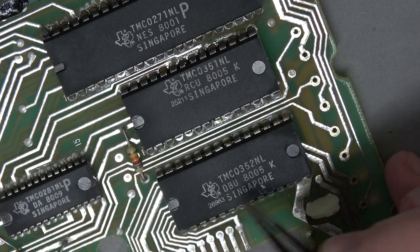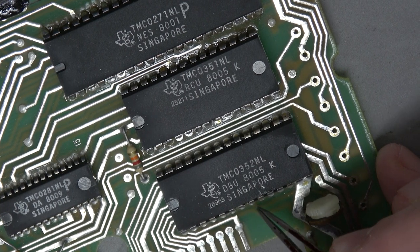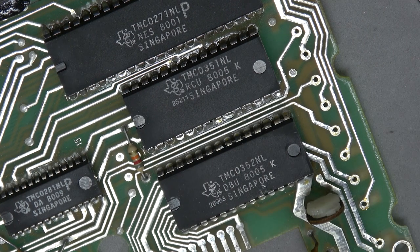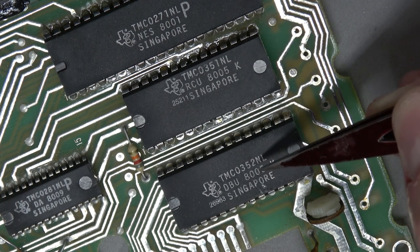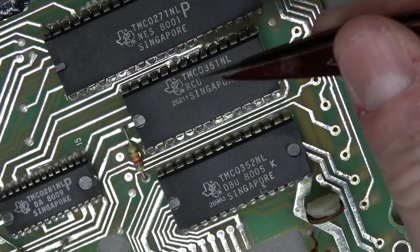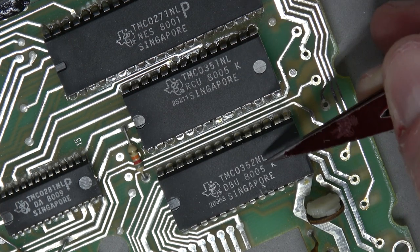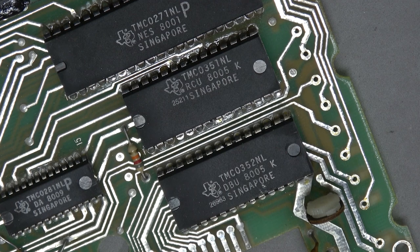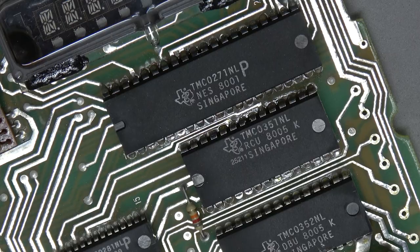Counting the pins — it's a 28 DIP, right next to the expansion slot, so I'm going to guess this is the ROM. The two VSMs — Voice Synthesis Memory chips — on the main board. I think I figured it out: the reason they have slightly different part numbers is because these are mask ROMs. It's not programmable — you make a mask ROM once and that's it. These are part numbers 51 and 52, each 16K, making 32K of speech ROM total.